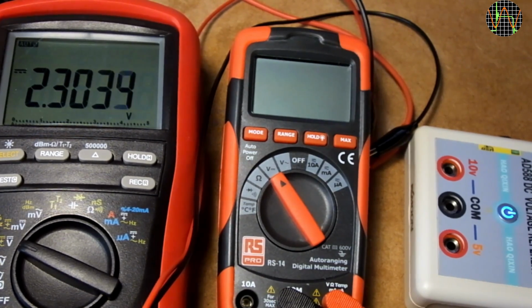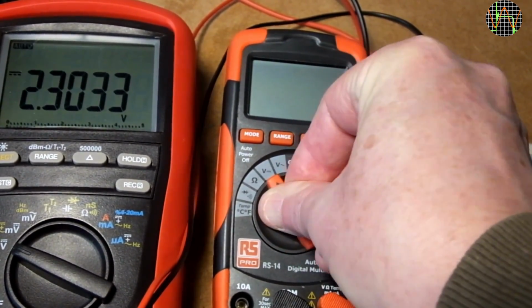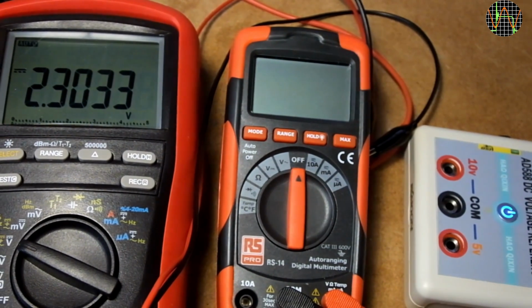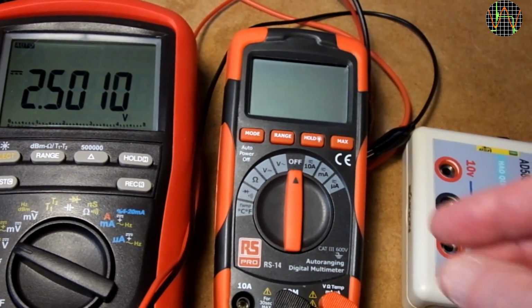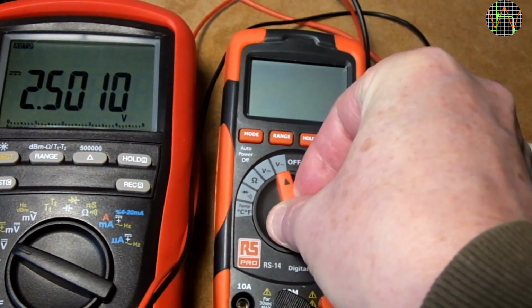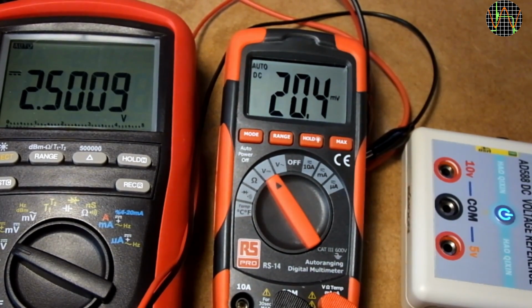This meter can be used until just about when the low battery symbol starts to disappear at around 3 volts. It definitely allows you to make full use of every tiny bit of charge left in the battery, and if you use rechargeable ones, the first full appearance of the low battery at around 6.5 volts or so would be a good reminder to recharge.